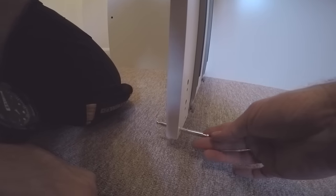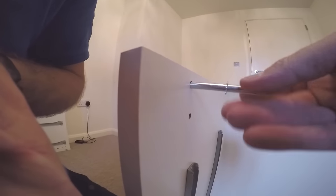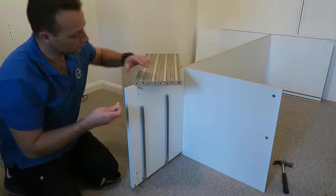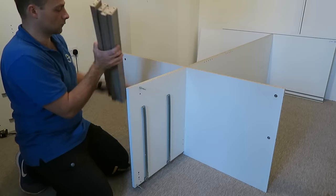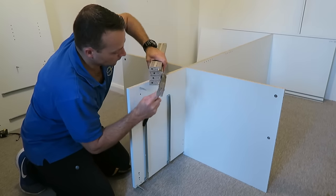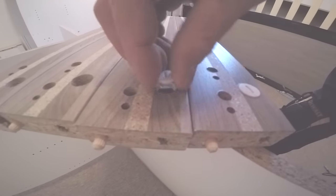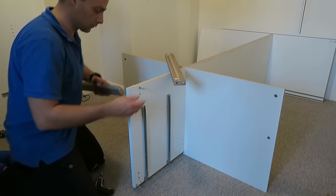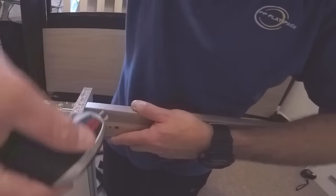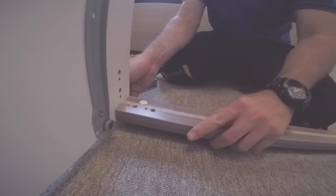This is the dividing part for the drawers — there will be two drawers on each side. You're going to have long metal bolts with a stopper at the bottom and on the top; just place them in to the stopper. In the bottom part of the wardrobe there are four slim dividing panels, one wooden plaque on each side and one plastic lock on each side. Point the locks in the right direction and secure one side, placing it on those metal bolts. There is a stopper so it won't let you go deeper — place it in and secure the lock.